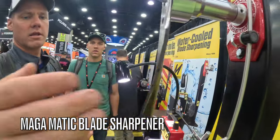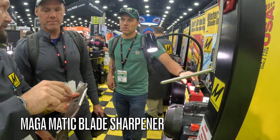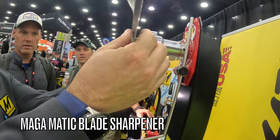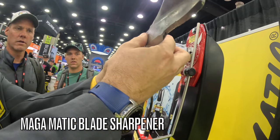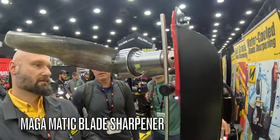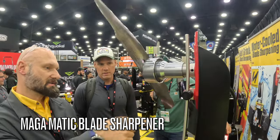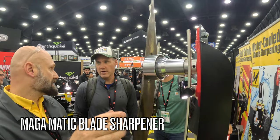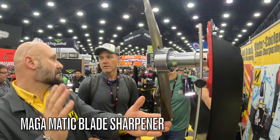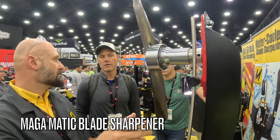So let me help you guys. What's important is when we're balancing a blade, we have to measure from the center of rotation. So we have to first locate the center of rotation on the cone. And then we can pull the magnet forward. Now the blade, gravity can bring the heavy end down. We get all of our information in a quarter turn. And because this moved so fast, this is very out of balance. If this would take 8 seconds to make that distance, it would be fractions of an ounce and you could use that blade. But anything basically 4 and under, you want to repair.